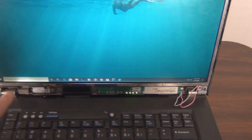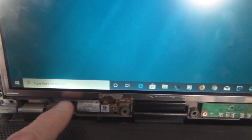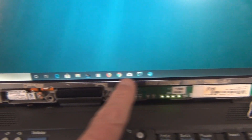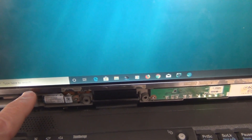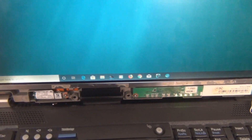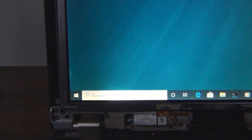Although it's not perfect — there is a little bit of a bright spot right here. I don't know if I didn't seat the CCFL bracket completely. I slid it in from this side because I was thinking the glass needed to be inserted into it right on top of the CCFL. I was surprised to see a bright spot. It doesn't seem to be showing on the viewfinder, but there's some light bleeding — the bracket isn't seated right, so some light is shining up through here. But it's not flickering anymore, and that's the original inverter board working fine.